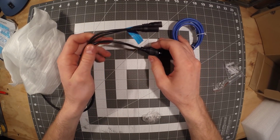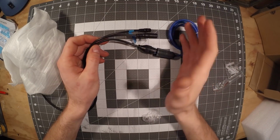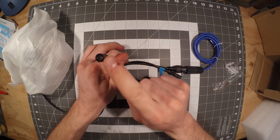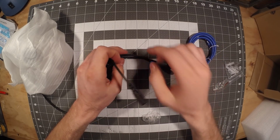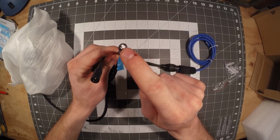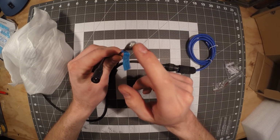And then you have that added problem where inside the building you have a good chance that it's going to be fairly safe and secure from water. The minute you put it on the outside of the building, unless you have a really good enclosure, which also adds to your cost, it just adds all kinds of problems. Eventually I might get around to actually seeing if it puts voltage on here, and I have seen, not with this brand, but I have seen it where these have corroded and shorted out. So I don't know about this brand. Even if that's not the case, this is still susceptible to shorting out due to moisture and causing the camera to be pretty much in a permanent reset state.